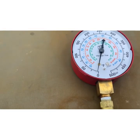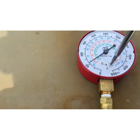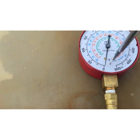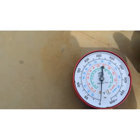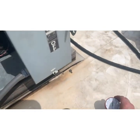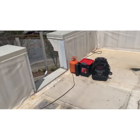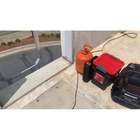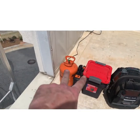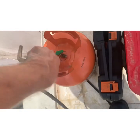So my high side is actually set a little bit high as well, so I'm gonna see if I can show you. We ever so slightly adjust how it responds, so that we can dial it into 0. There you go. And we're set. And then the cover just slides on like that. The worst part about those little stubby gauges not being calibrated isn't making a stupid mistake or not paying attention to a little detail. It's that I didn't need those two things up here. I did not need to bring the Freon or my gauges up. And now I gotta get them down.